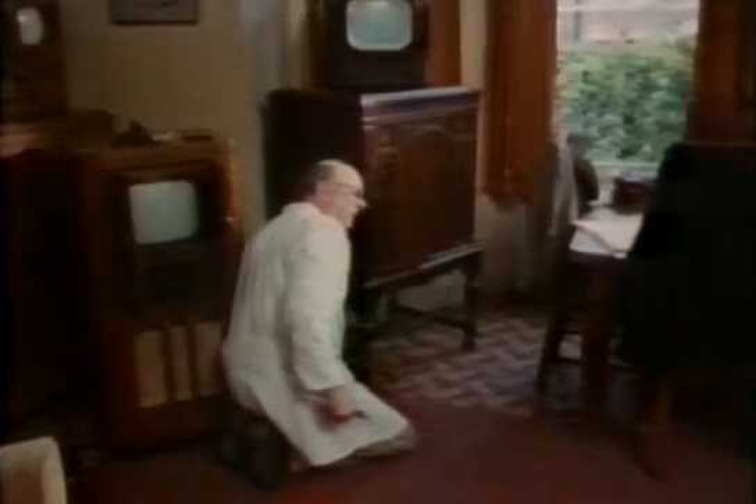Gerald Wells, who runs the West Dulwich Radio Museum, has collected some of the first domestic television sets. His earliest set doesn't look like a television at all — the Model 900. It's probably the first television in the country of its time, bought out in time for television. It was originally dual standard, with a switch for 240-line and 405-line, so it could watch with the Marconi EMI system or the Baird system. It doesn't look like a television because in those days the early cathode ray tubes were so long in the neck that the only way you could mount them was vertically, with a mirror in the lid. The scanning coil was reversed so the picture was right way round and you actually watched it in a mirror.